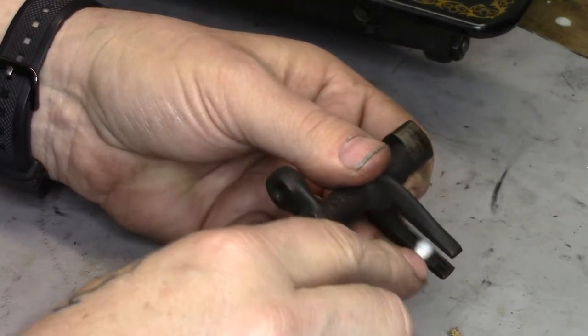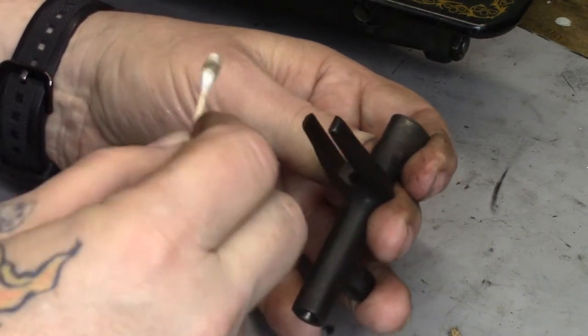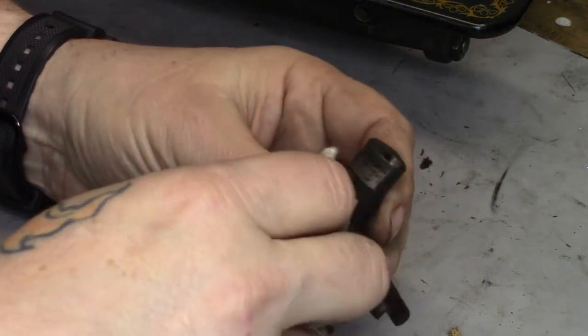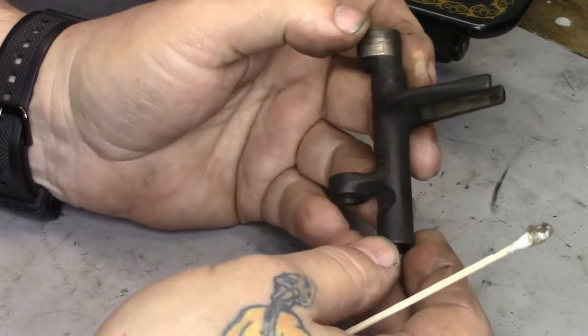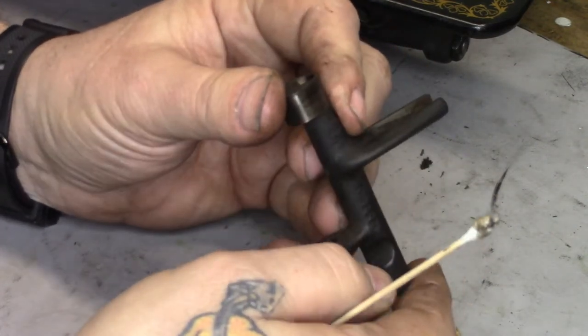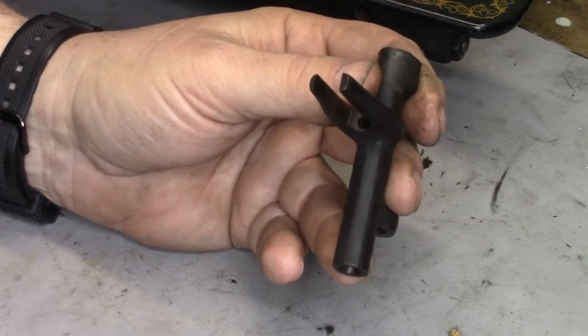What I want to do is make sure that these bearing surfaces here are going to be polished. I'll do that with a rotary tool. Actually, I just want to take this to the sink and degrease it rather than wire wheeling it, because this does have a black oxide coating on it. So I'll be right back — I'm going to clean it and blow it dry.